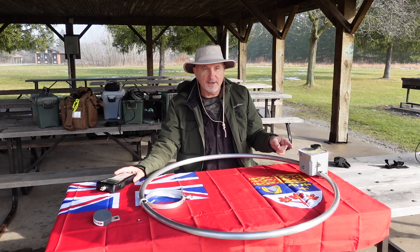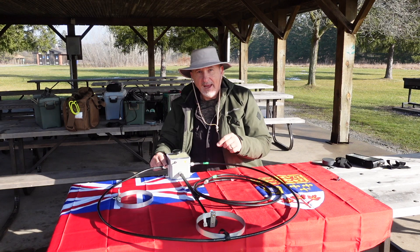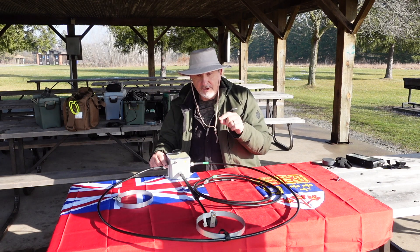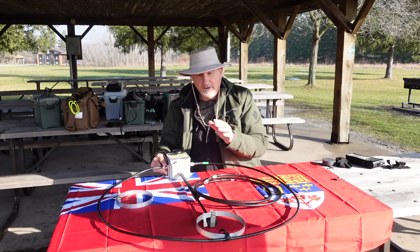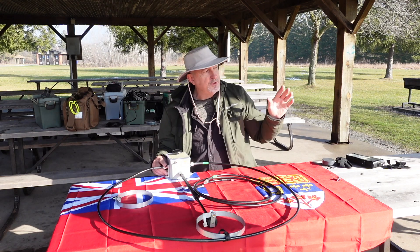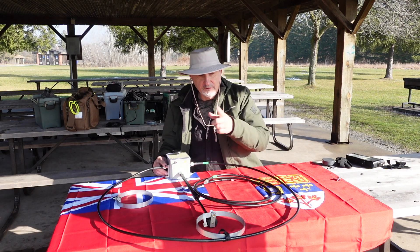Now we're going to try replacing the aluminum loop with a coaxial loop. Using that method, with a single loop as opposed to a double coaxial loop, we were able to get a dip on 10 meters. We haven't done a lot of testing on the other bands, but we were certainly able to get a dip — which we were absolutely not able to do with the aluminum. We were far more than 10-to-1 SWR across the entire spectrum using the aluminum.